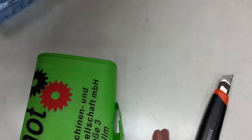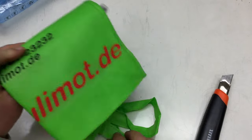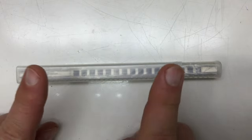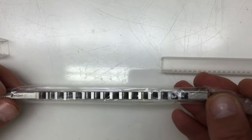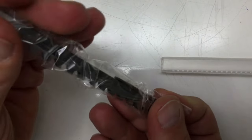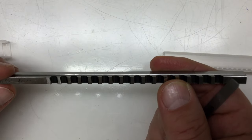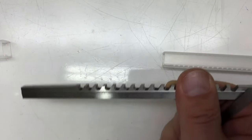There's some paperwork — nothing suspicious. We get a bag, which is a nice bonus. First of all, we have a broach, and that is of course for cutting a keyway on the inside of a hole. To be exact, it's for a 5 millimeter keyway. The inside of the hole will be in an aluminum plug inside a 16 millimeter hole, so everything is coming together.